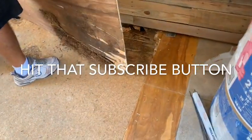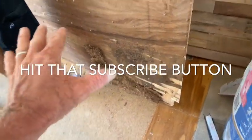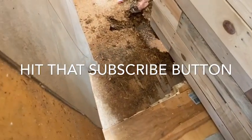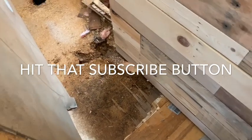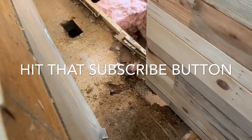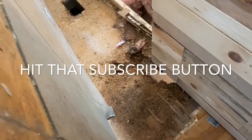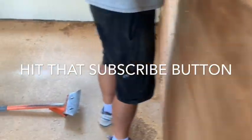You don't. So they did all the repairs they thought they needed to do and went ahead and put new glue down on the floor and put new VCT tile. And it got wet again, obviously from the dryer, because that's the other side of the dryer. It got wet again, and then the floor deteriorates. Then what do you got to do? You got to tear up all your VCT tile, tear up your Luan, do your floor again, and start over. They should have just torn the whole floor out all at one time and been done with it.